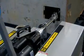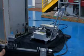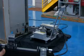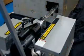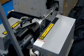The locking sleeve of the socket captivates the circuit breaker levering shaft pin. The racking cart is connected to a 120-volt AC outlet. By depressing the circuit breaker rail latch and operating a jog button on the cart, the circuit breaker levering shaft is engaged onto the circuit breaker levering screw. If needed, both jog forward and jog reverse buttons are included at the racking cart's handlebar.